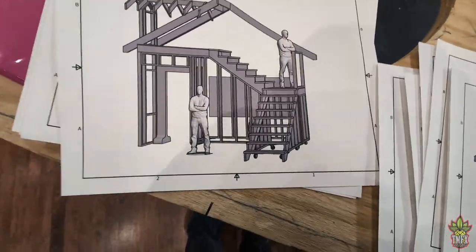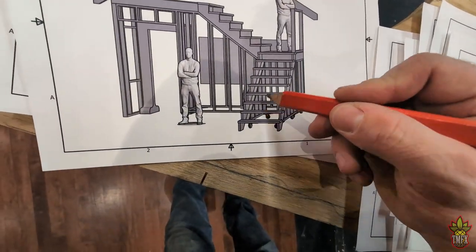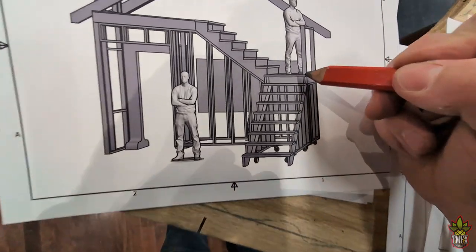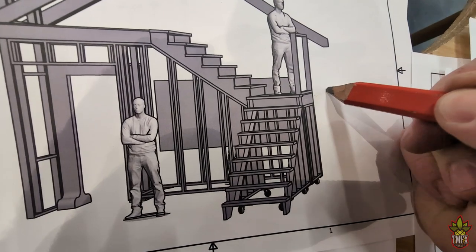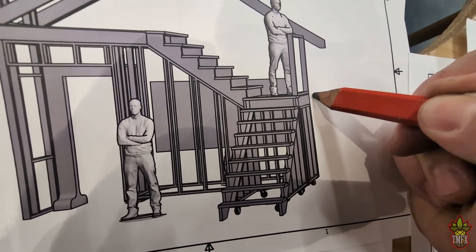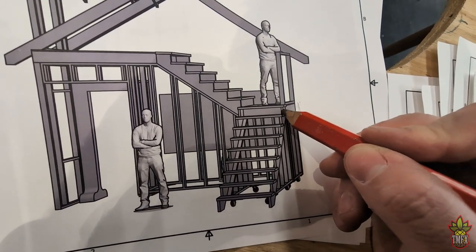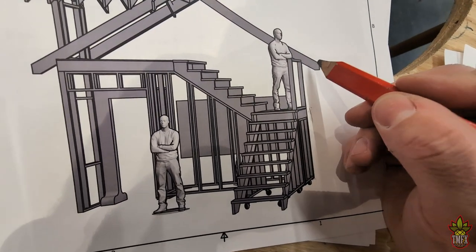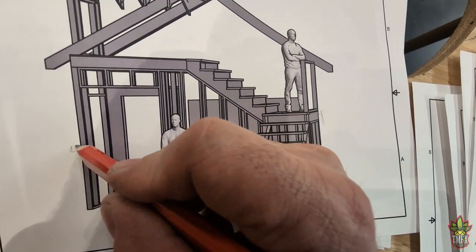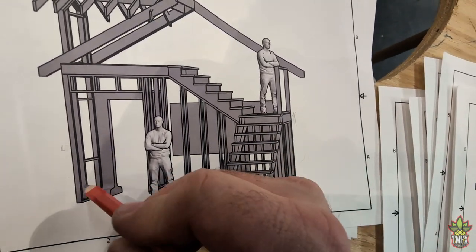However, it's kind of tough to describe, but if these stairs go up against the inside wall of the house, the framing wouldn't actually sit in there. It would be to the outside. It would be stuck to this face and be greater than this face. So there'd be a full wall thickness on this side before the rafter landed. And then there'd be the same brick on this side as there is on the other.